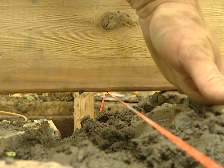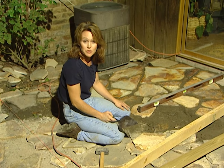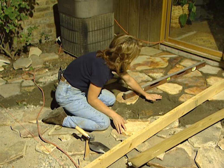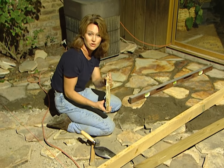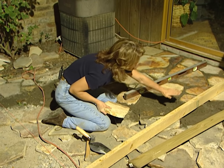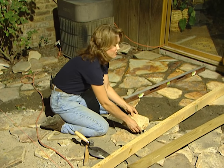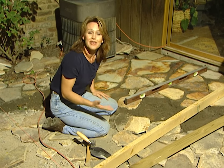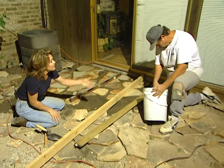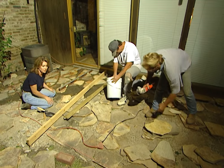When the bottom of your board sits just on top of the string line, then you know that your stones are set at the right height. We're several hours into our project and as you can see it's pretty slow going, because you have to have three courses of cement for each and every stone, and it takes time to use your level or straight board for each stone to make sure you keep the slope going. You can do all of the prep work and even the dry fit by yourself, but when you get to this point you might want to call in some family and friends to help. We've got our technical advisors: Brian is mixing the setting bed, and Jeff is cutting some of the stones for our problem areas.